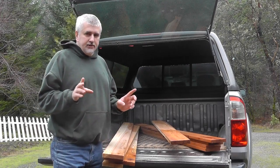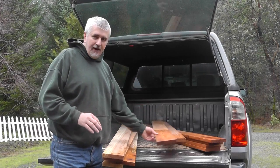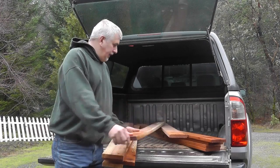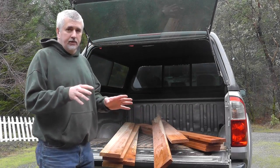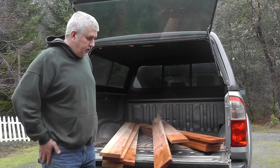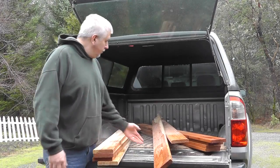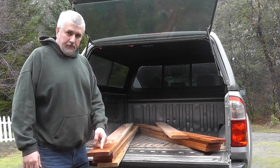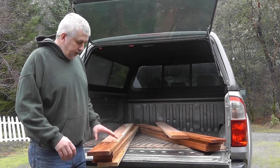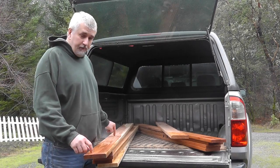And I don't want to do that because I would have to cut into another board, and I want to make this project out of just 5 boards. So I'm going to rip 1/4 inch off of this. And by the way, I'll explain that and you'll see it once I start to assemble it. You'll understand why. So I'm going to rip these 4, and then I'm going to take the 5th one and rip it right down the center, about 2.5 inches or so, a little over, 2 3/4, and this is going to be my trim.